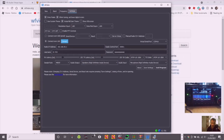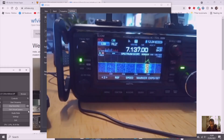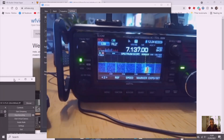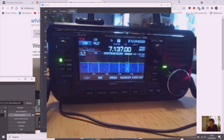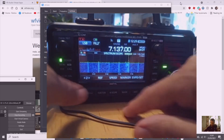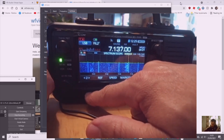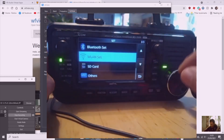On the radio, what you want to do is create a wireless link from the radio to the laptop using the wireless LAN and an access point. We need to set up the access point with a username and password. Mine's turned on at the moment — go Menu, Set, and we'll go into Wireless LAN Set.